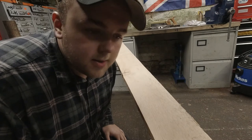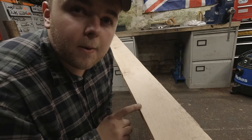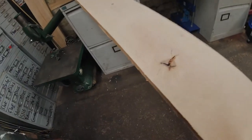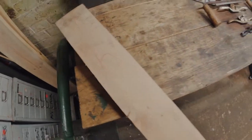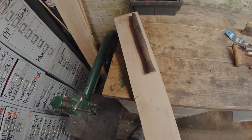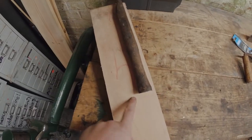Now I could be wrong, but I'm pretty sure it's wood. On a serious note, I believe this is English Ash. It is quite knotty this piece here, but it is really really nice wood and I've got an abundance of it. I am going to use this end — how I've stored it has gone a bit manky, but the other end is absolutely fine. So we are going to cut off a piece probably about here. When you re-shaft a hammer, keep the old hammer as a template. We're just going to cut across here nice and square, and then we'll split it down here — maybe with an axe or a chisel.